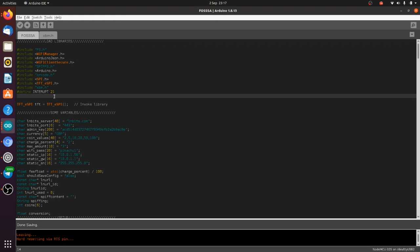With the old version of the FOSSA we had a relay — the idea being that when the FOSSA is fetching the LNURL to display, we don't want to be able to put more money in at that point, so we'd turn off the coin mech. Before I had a physical relay, which was a bit of a pain. The new coin mech has a really nice interrupt pin. We can send a HIGH to that and it will turn the coin mech off and not allow any more coins to come in.